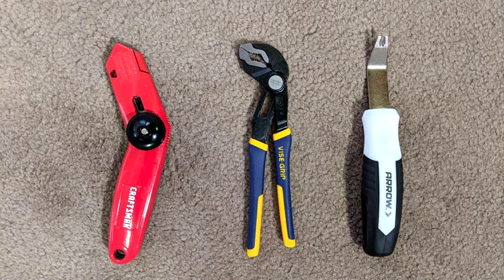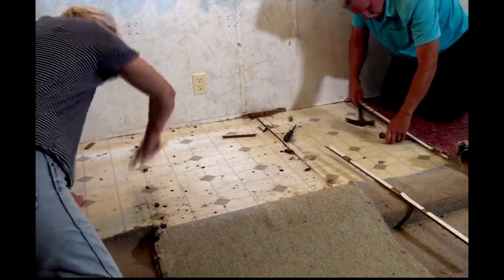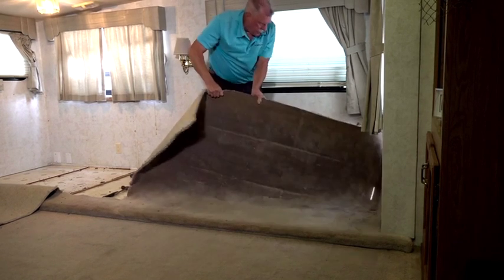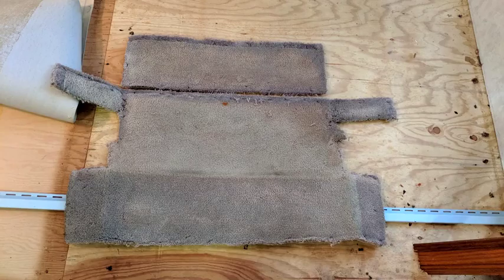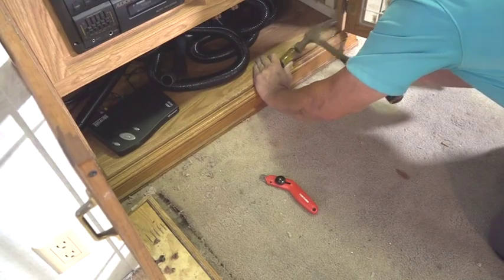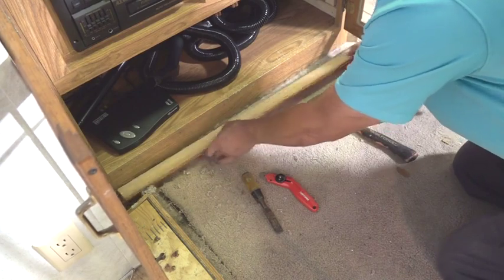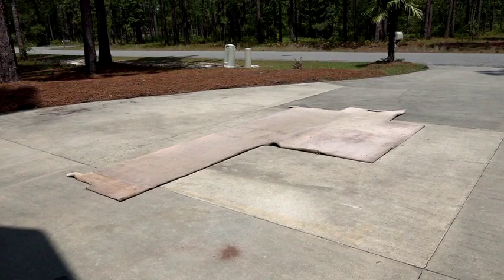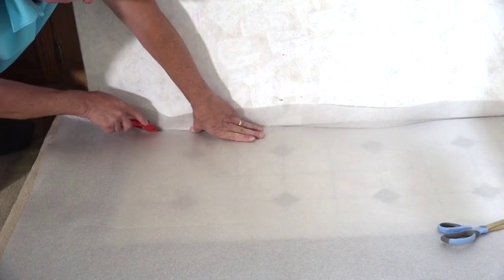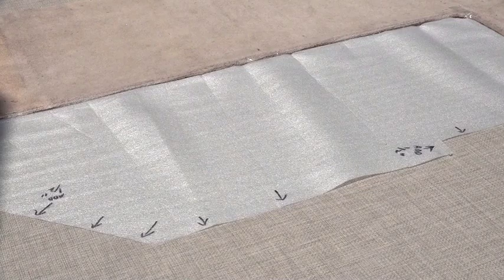Tools that are helpful for removing flooring include a razor knife, a staple puller, and a pair of pliers. When you remove carpet, there are tack strips securing it to the floor and lots of staples. After a piece of carpet is loosened, you can pull it away from the floor one section at a time. I plan to use the carpet from the steps as a template too, so I was careful removing it. It might appear that carpet goes under base cabinets, but if you remove the bottom trim piece, there's a good chance it does not go under the cabinet. We decided to replace the old wood flooring too, so we removed it. For areas of the room without carpet, I used an old roll of laminate floor underlayment to make templates, with notes to remember where each piece goes when preparing to cut the new flooring.